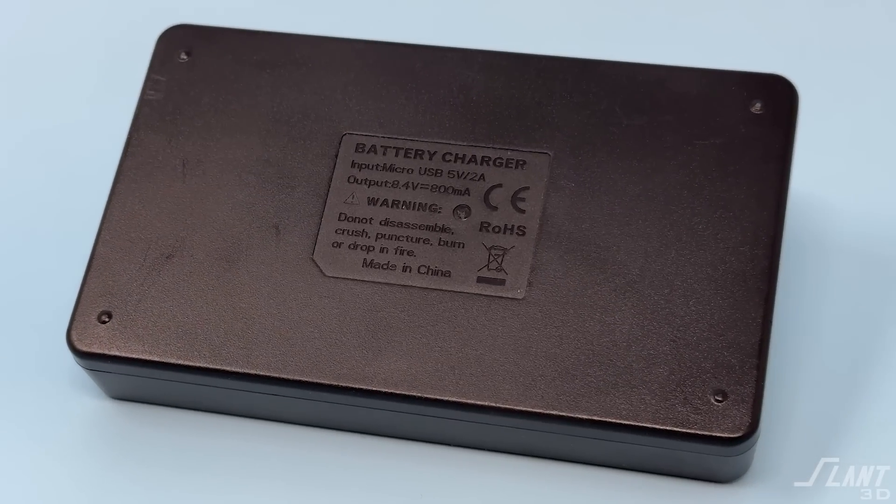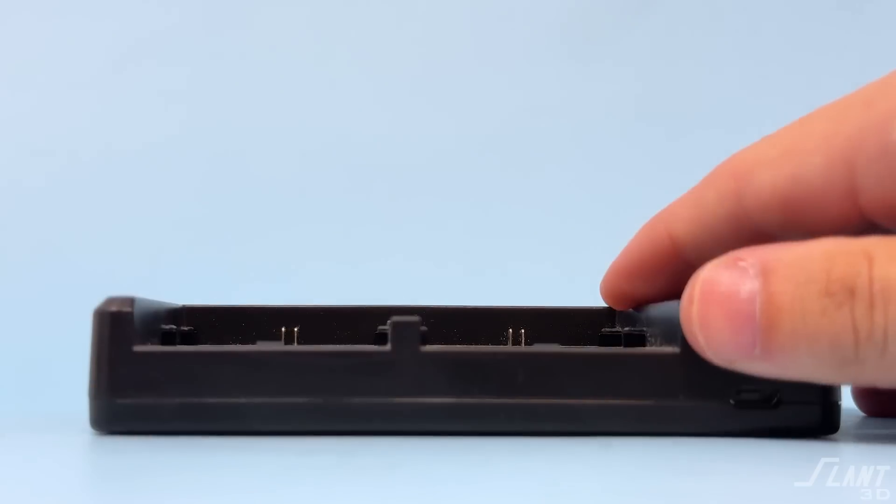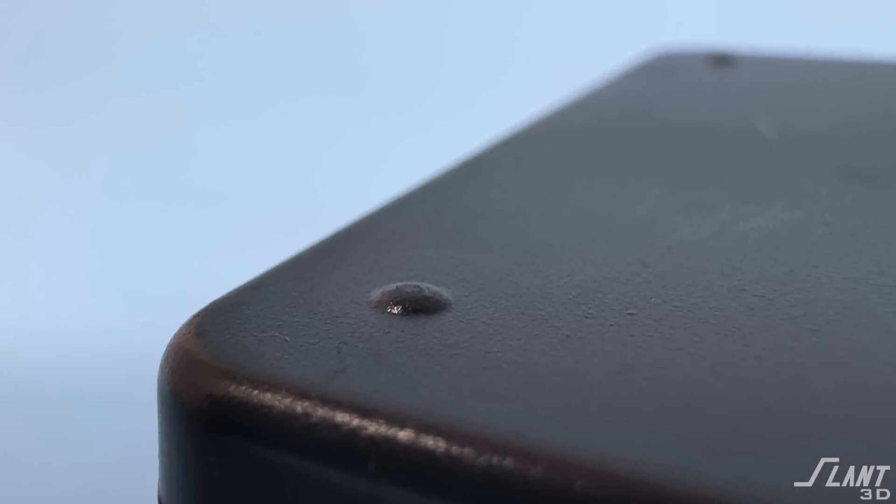There's a style of feet that don't really go anywhere — they're meant to keep an item in place, and that's what we're going to talk about in this video. Many products actually need feet: small protrusions of plastic at the bottom of a part which make sure the item sits flat. It also improves the overall aesthetic rather than having a big block sitting flat on the table, and you can have it lifted up just a little bit. You might also have a functional application where you're putting it in a moist environment and the feet can lift it up so water and liquids can flow underneath. Feet have a lot of applications, but people don't always design them correctly — they're often an afterthought, which is strange given how important they are.